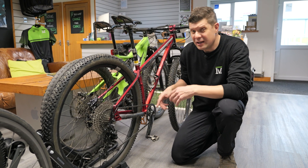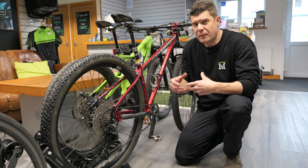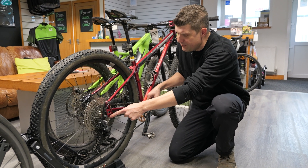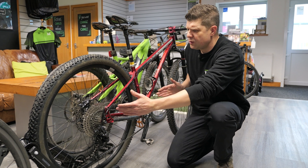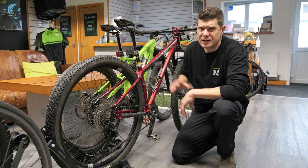Quickly to cover off mountain biking — while all this was going on, mountain bikes were introduced with a 73 millimeter wide bottom bracket so that from the very outset we could have much wider tires. We still needed to make the chainstay significantly longer, but that wasn't so much of a problem in mountain biking where the wheelbase added to the stability of the ride, though we still wanted to make sure it didn't get out of control as tires got wider and wider.